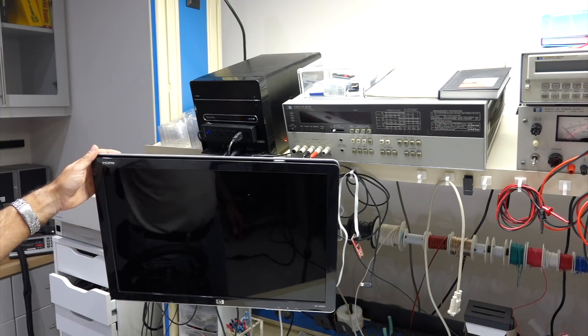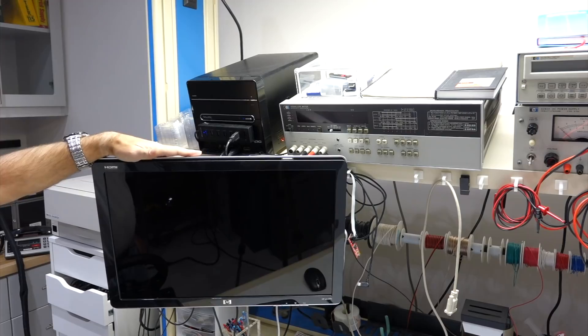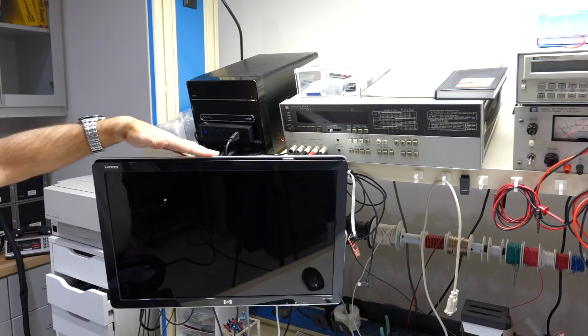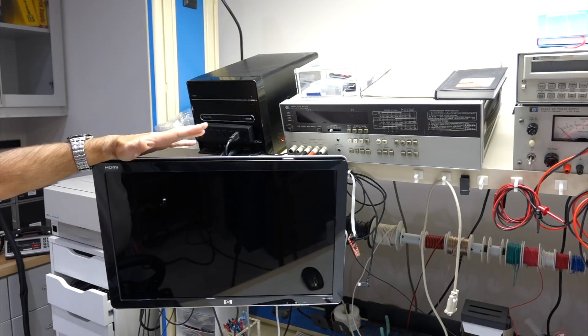Which tells me it's very likely a power supply failure of some kind. This is a relatively modern piece of equipment, manufactured around 2010. I wouldn't be surprised if it had been yet another victim of the Taiwanese capacitor plague, and if it had a bad electrolytic capacitor in it.